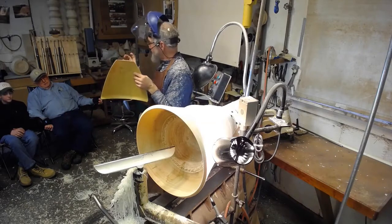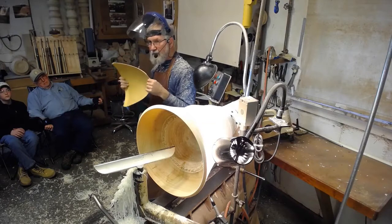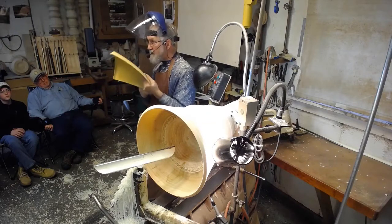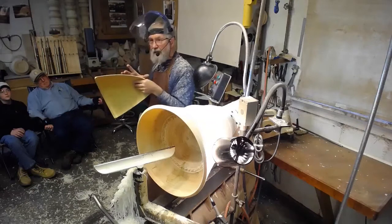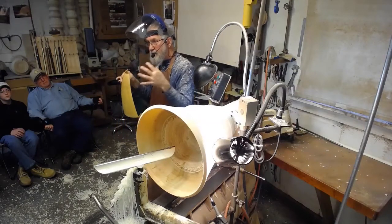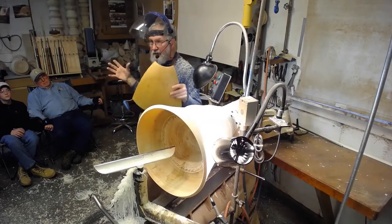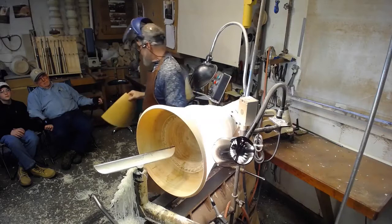If you put the shade ring in tight, and then you get a dry day in the middle of winter with wood heat, which we have in our house, it would clamp on there and cause a crack here because the wood would have to give. The clear silicone stays soft forever, and it's been a great system.